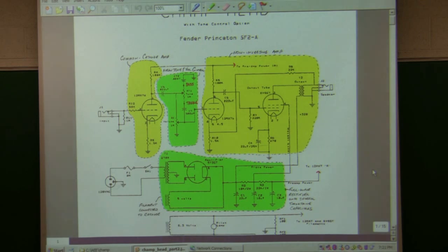So it's called a common cathode amplifier. It has a gain around 30 or so without a load. Now, a load is when you hook up something like this, and it'll cause the gain to drop a little bit. Sometimes it'll drop a lot. You have to be careful as you interconnect stuff. And then what we'll do is run the simulation of the whole thing. We'll see all the loading effects included.